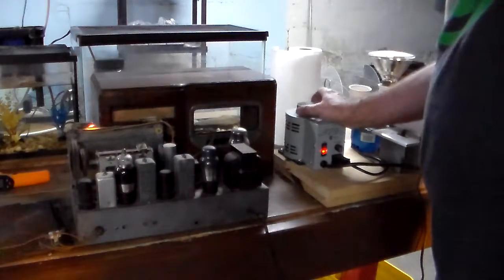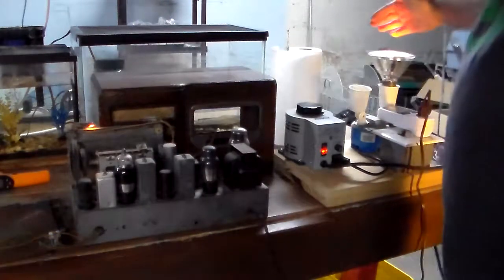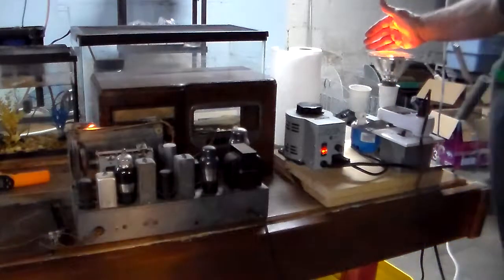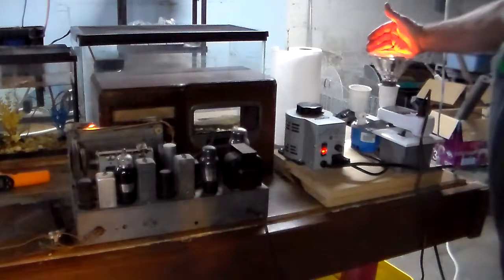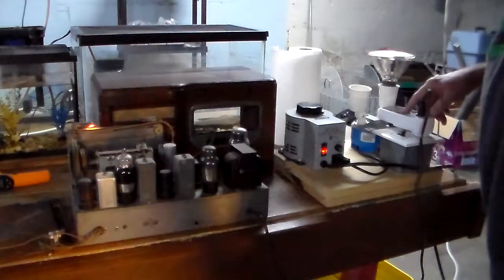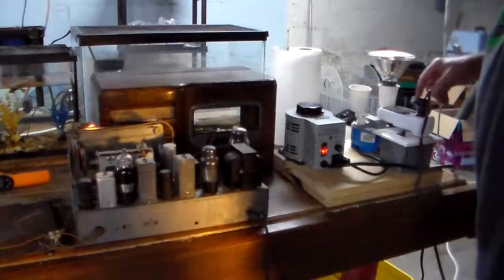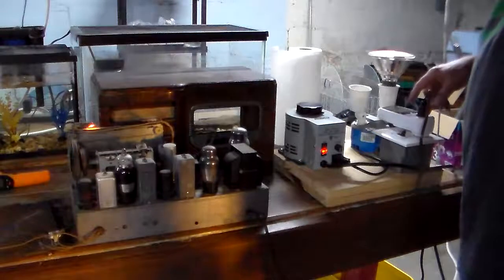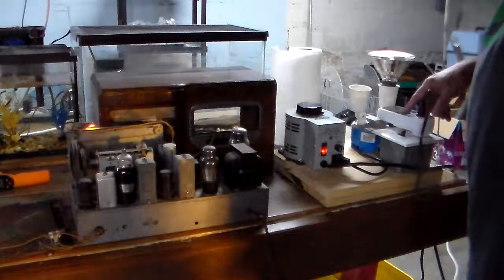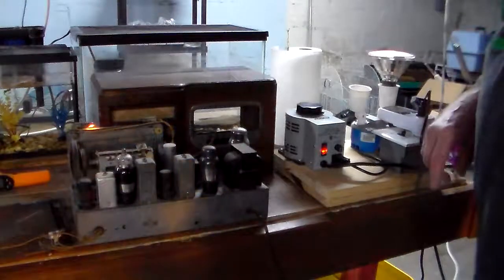Alright. So there we go at 91, 94, 97 volts. The light here is getting a little bit brighter. If you look on my hand, you should be able to see the reflection. It's not super bright, but it's bright. Let's just see what we're talking about now with current. Still less. It's actually 0.03 of an amp. So still nothing that I'm that worried about.